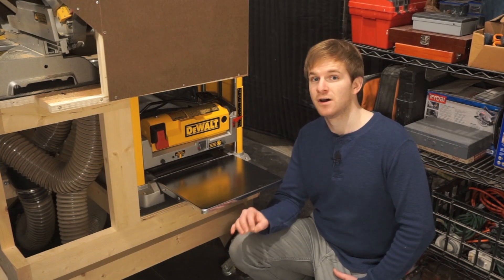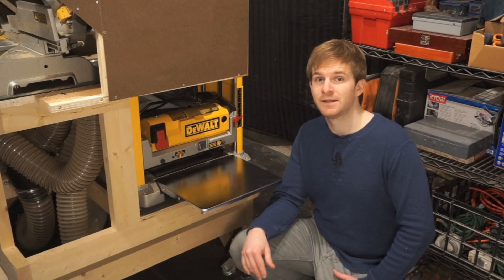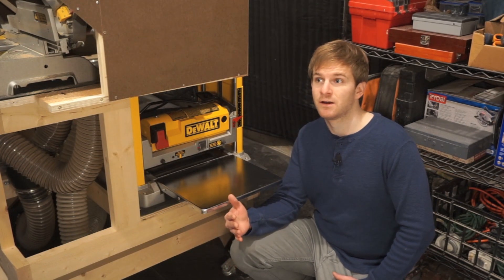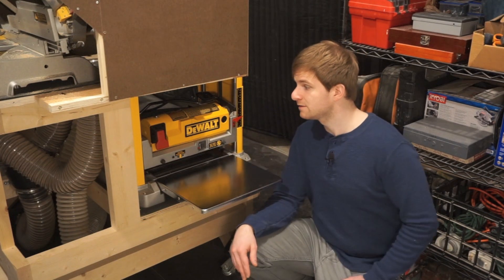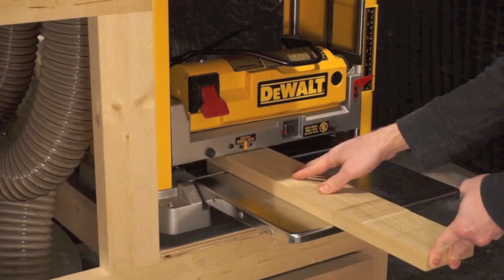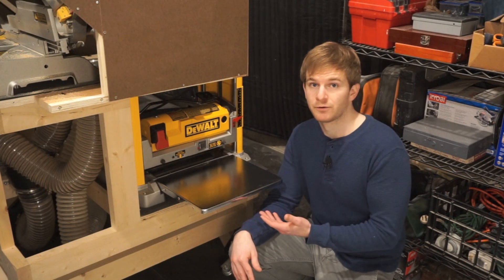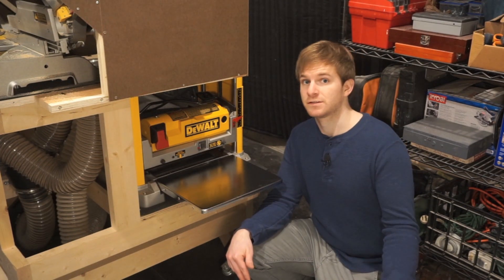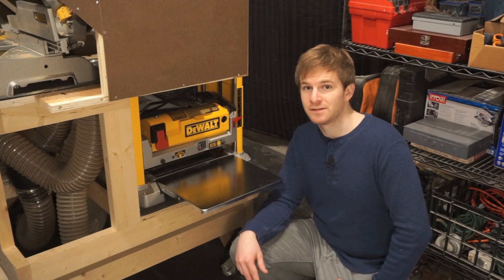This process is not hard but it can be achieved very efficiently if the right steps are taken. When I first did it I wasn't sure exactly how to do it, so it took me a while to figure out. The reason I changed out my planer blades was because I was getting really bad feed rate. If you're sending boards through and they literally won't go through, oftentimes it's because your planer blades just need to be rotated. If you've already used both sides, you'll probably need to buy new ones. Let's get started changing out these planer blades.